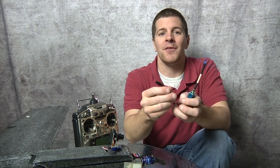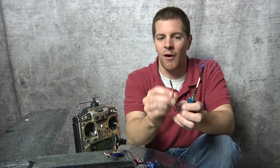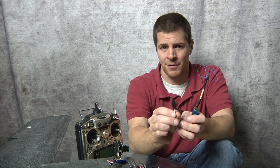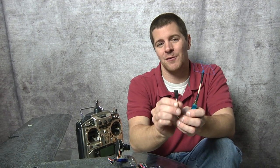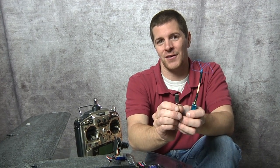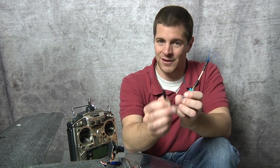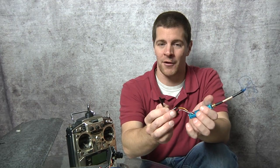I make it real nice to plug in so I can connect all RC components I'm used to. Remember, this is usually 12 volts. You don't want to plug a servo into this, so make sure you label your wires properly. Because if you wire a servo into your video system, it will burn it up.